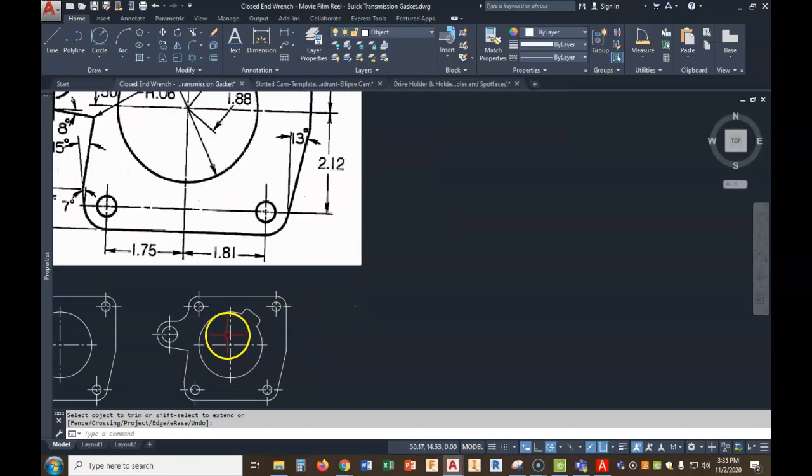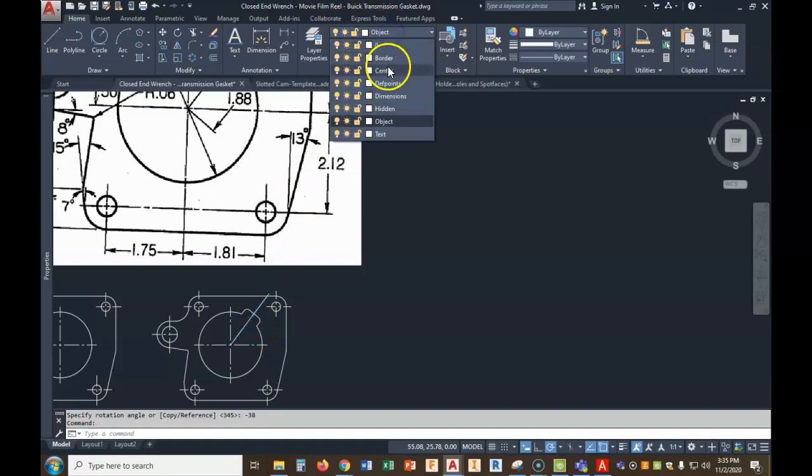Pretty neat, huh? It's worrying me that I don't have that center line in there. You know that? So you know what I'm going to do, don't you? I'm going to put it in. I'm going to draw me out a line. I'm going to rotate that line around the midpoint. 38, negative, because it's to the right. -38 degrees. There we go. Turn that into a center line.